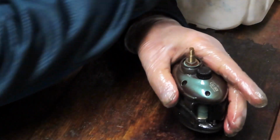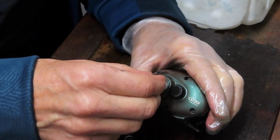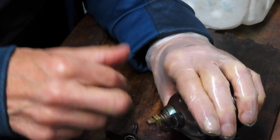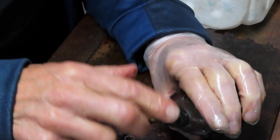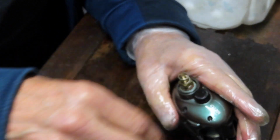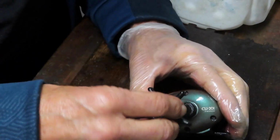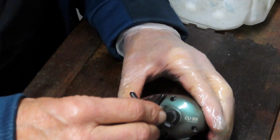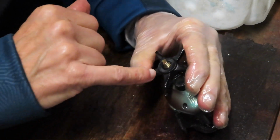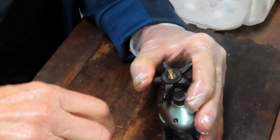All right, now we can come back in with the adjuster assembly. And remember we had the square nut, and again this is left-handed, so you're going to thread it counterclockwise, which is also counterintuitive, but that's the way it works there. Next up is the spring, which I stored inside this. And now this one, you want to press down on this before you put the handle in. You've got to get the clearance for the handle. You need to seat that square with the square of the nut. So it's kind of a little juggling game, but when you get it, then just find the opposing ones so you can get the handle on and still hold the nut, kind of like what I'm doing here. We can put our handle on.